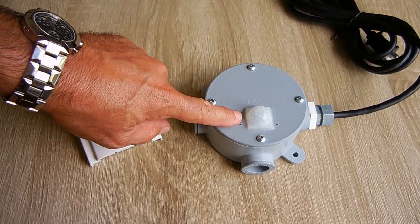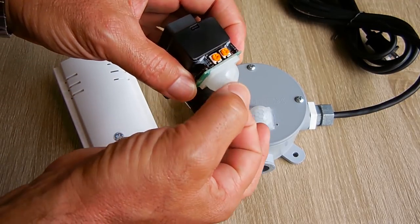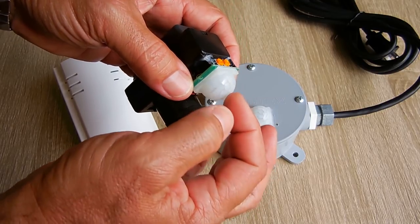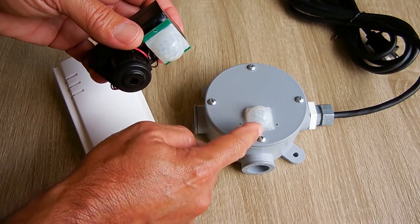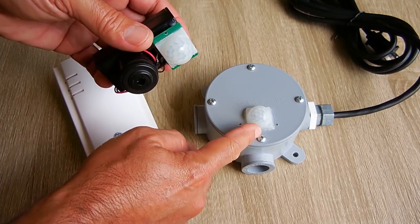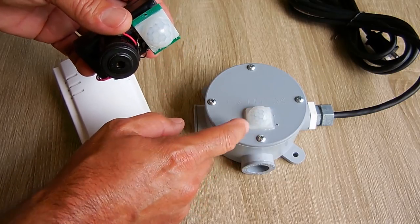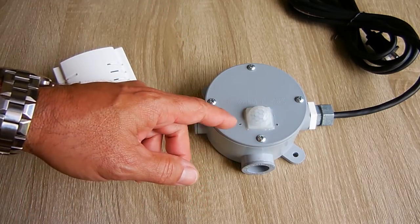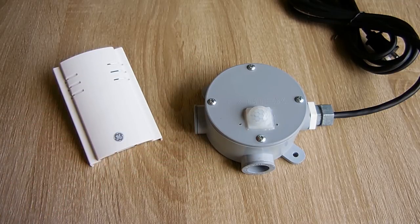Now the cover here is popped off of this. I glued this one on. This cover is only on this side — I drilled a 7/8 inch hole and centered this over the hole, and I used clear silicone to attach it to the PVC cover. On the other side of this cover is the circuit board, held in with double-stick tape and also with some silicone sealant. Now let me go over the schematic so you know exactly how it's made, so you can make one too.